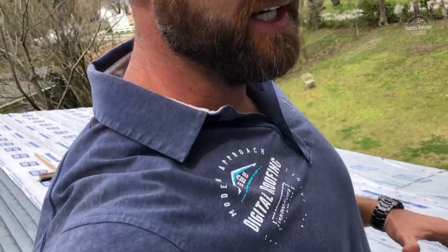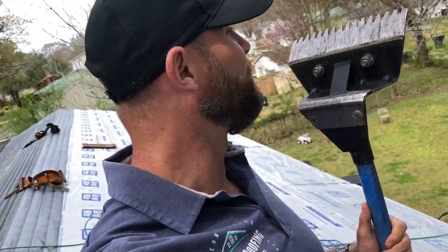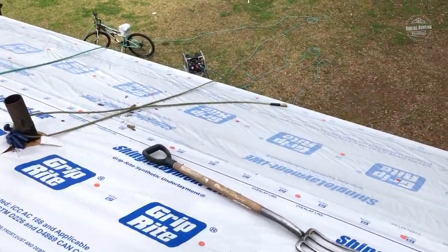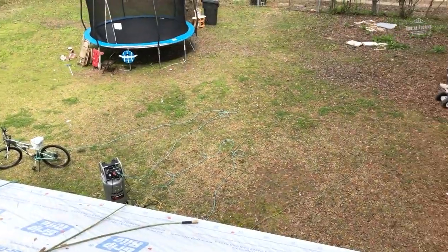Make sure you're using proper ladder safety — we have several of those videos on the YouTube channel. The tear-off process is pretty easy; it's just getting rid of all the stuff that was on the roof. There's a few tools you can use: here's an asphalt shingle removal tool — we'll have a link in the description. A lot of people also just use a pitchfork, which is a tried-and-true method, though the shingle removal tool works a little better but is more expensive.